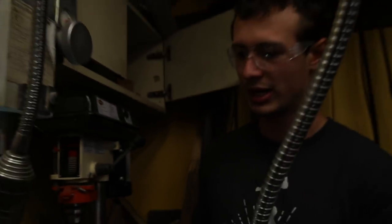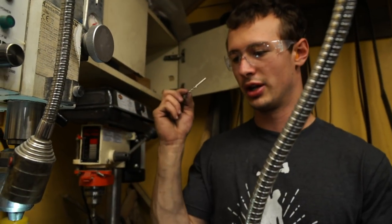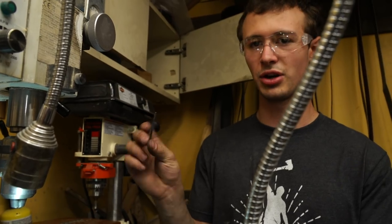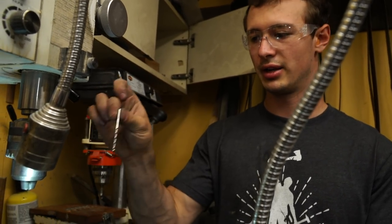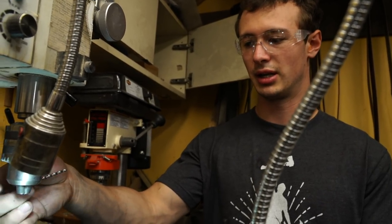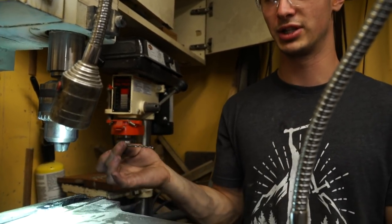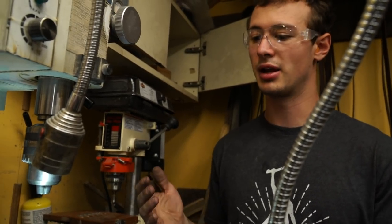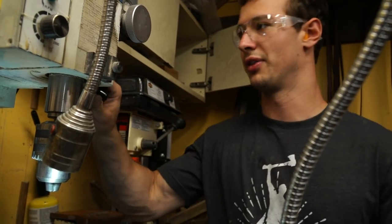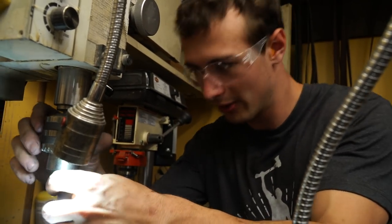So what I'm gonna do is take an 1/8 inch carbide drill bit, drill it out and see how much gap there is on the top. If there's still a little more gap than I'm comfortable with, I'm gonna go in with a number 29 drill bit, which is 135 thousandths. It's 10 thousandths larger in diameter than an 1/8 inch bit. Aesthetically, on our pin pattern here, it won't look any different than what I had planned, but it might be enough to actually take out that crater on the top. So I'm gonna start with an 1/8 inch, and then if I need to use the number 29 drill bit, I will.